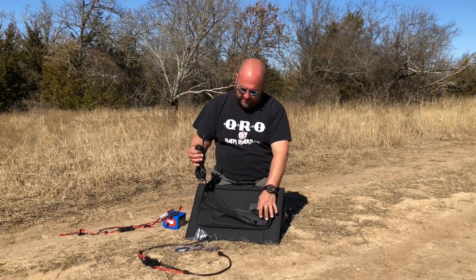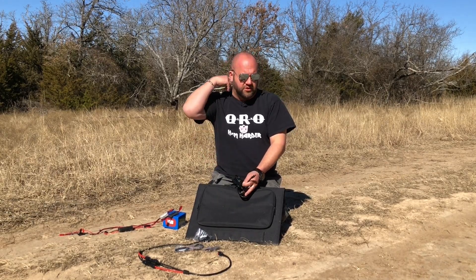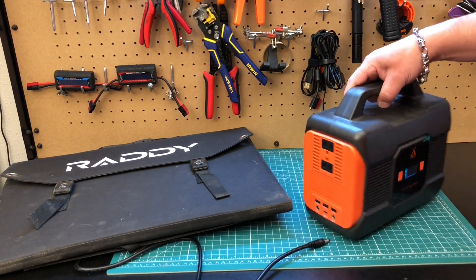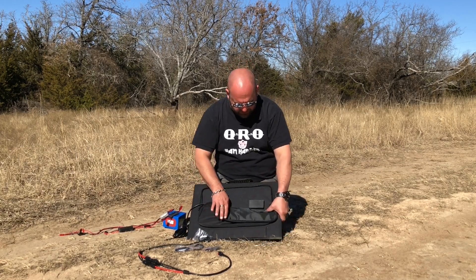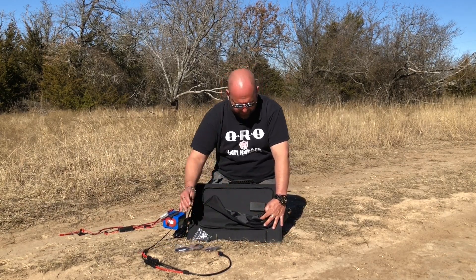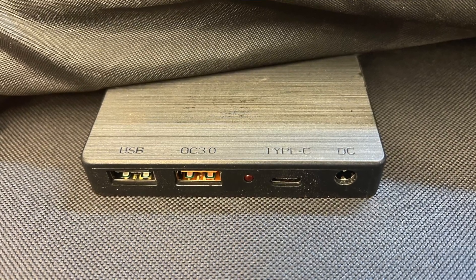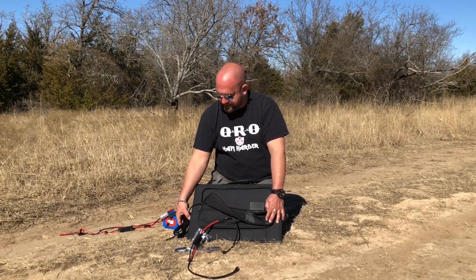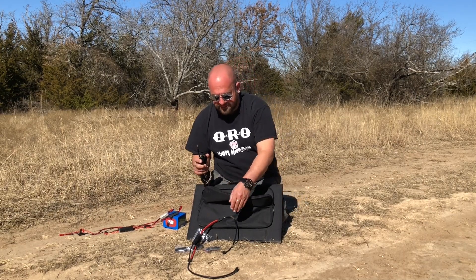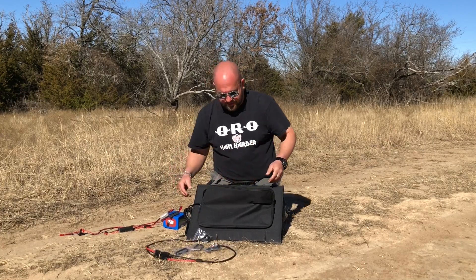It also has a wire lead that is hardwired to the panel with a barrel connector. I'll probably cut that off and put Powerpoles on as well, but they included this connector because it's designed to plug into Radiotity's portable solar generator battery box. There's also a little pack with a barrel connector, a USB Type-C, a USB QC 3.0, and a standard USB. So quite versatile. I've checked the current draw from both outputs and they're exactly the same — neither is more or less powerful than the other — so you've got options.